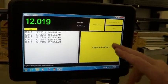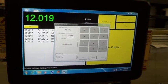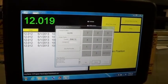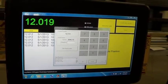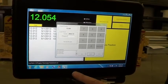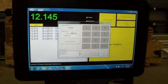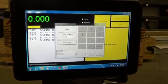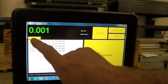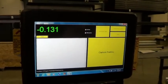The other features of the software are the setup screen. In the setup screen, it gives you the ability to change the scale factor — that is the number of counts per inch on the encoder. So if you measure a long part and it's a little bit off, you would adjust the scale factor to bring that in. It's something you do initially, maybe once a year or once every six months. The setup screen also shows you all the communication between the card and the PC, which is useful for diagnosing problems. You can also zero the encoder from the setup screen. You can change it from inches to millimeters and clear the capture screen. That's really all there is to the caliper table software.